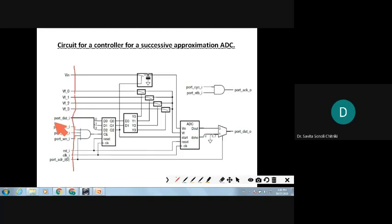So you can see the signals here, port data, port cycle, then strobe is there, right, control signals, data in, cycle, strobe and write enable. Data in is connected to where all, see there, D0, D1, D2, right. Cycle, strobe and write enable are all connected to chip enable, right. Then next, what else you need, reset, reset is connected, then clock is connected. So the same clock is being connected to ADC also, same reset is connected to ADC reset also. Then port address, see there, port address I of 0 is connected to 01, right, rest all, this is all conversion, mean.